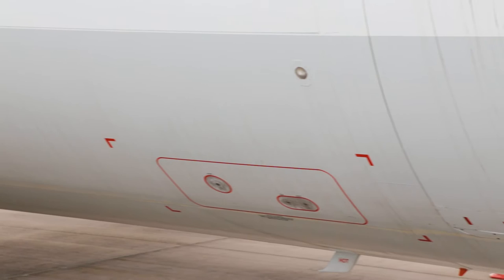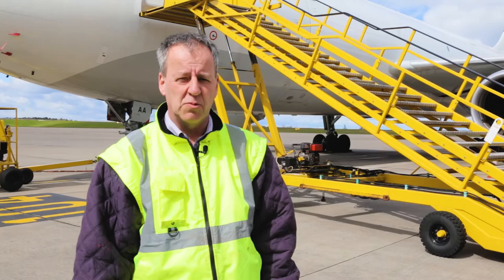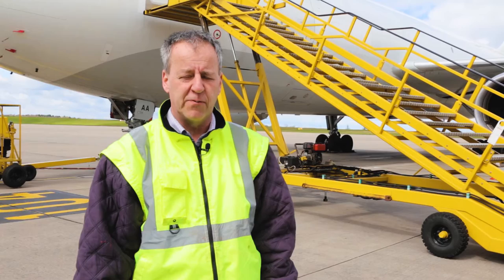the APU inlets. It can cause problems with vaporizing into the cabin, can be mistaken for smoke, and has created air turnbacks, so an emergency situation, so very important. Also, any doors, hatches, windows, personnel must be clear, and ground power units, ground equipment must be clear. Particularly also the fuel bowser, the fueling truck, must be out of the vicinity before de-icing, anti-icing takes place.